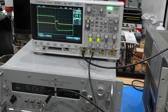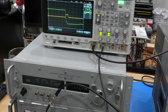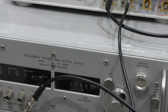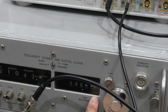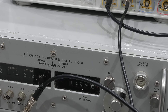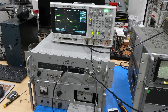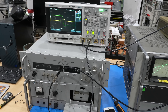So now we have the two clocks synchronized. You can see that the cesium and the quartz are, to the first order, indicating the same thing. And we ended up with 132 milliseconds — 492 microseconds. It really does the microsecond thing. You can probably get half of that. And then you can compare the clock drifts — imagine you have another clock, and you can let it run for a year and figure out how many microseconds you've drifted off. So that's the whole point of this clock.